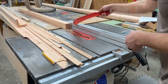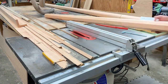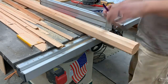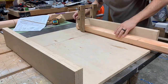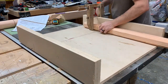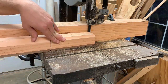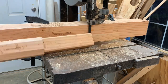For this piece I needed to end up with a 2½ by 2½ inch square, so I cut that a little oversized on the table saw and then ran it through the planer to get down to the dimension I needed. Next I used the table saw to cut a 45 degree bevel on each of the corners, simply following the directions in the plans. The plans also call for rounding off the last 7 inches of the tip of the bowsprit. I'll use the table saw to cut in a ¼ inch deep shoulder around the perimeter of the piece, then use the same technique I did on the mast — taking the piece from 4 sides down to 8 sides and then down to 16 sides, and finishing up the round with sanding.